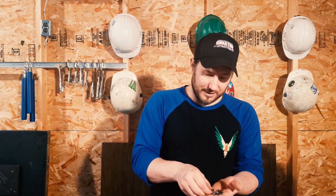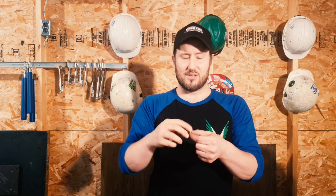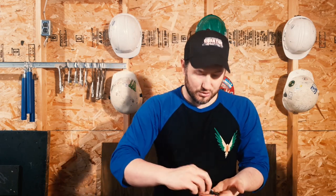Now the drywall gun itself uses this standard phosphate screw — this is an inch and a quarter drywall screw. You can see the number two Phillips, it's pointy and it's black. That is the regular drywall screw. Then we have the zinc coated screw which is for heavy gauge — you can see it's got a self-tapping end. We call these self-tapping drywall screws — heavy gauge self-tapping drywall screws, inch and a quarter long.